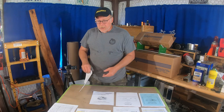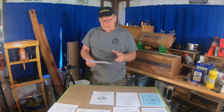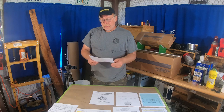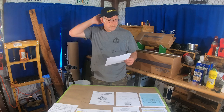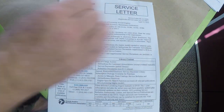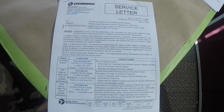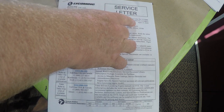Number one document we're going to be looking at — and this is for Lycoming — is we have to know what documents are good. Now whether it's Lycoming or Continental, they have the current list of effective publications, what publications are still good and legit, or the latest versions. For Lycoming, it's the L114, currently up to revision BH. It has been revised many times — every time a new document comes in, a new engine comes out, they have to have a manual. So we're going to be using the L114 document for Lycoming as our guidance. It's a service letter and information letter.